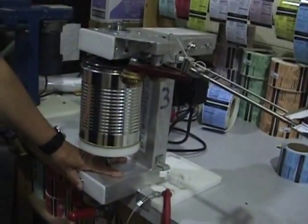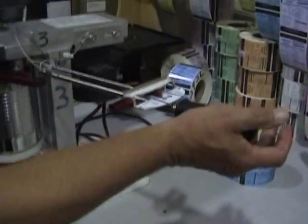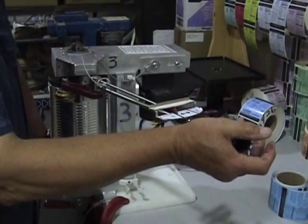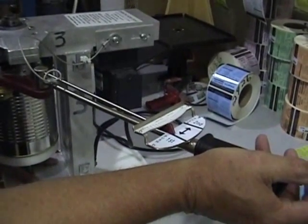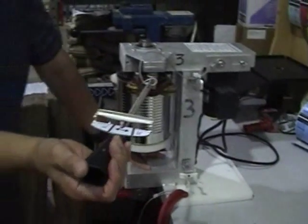Push and turn. And now the first object is to push. This is the first round. You go slowly into it, slowly to the black mark on the torque wrench. Then you hold it for 3 rounds. 1, 2, 3. Then the second one is a pull.